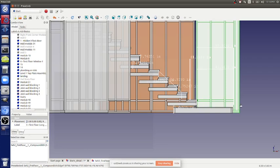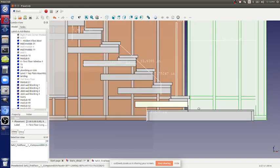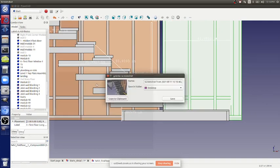From the outer framing, so you can only measure from inside, but the walls are exposed. You see where the wall ends, so you're not on two studs. That's fine. You attach it to these back ones. Okay. So you attach to this stud and that stud for the one that's back there. Perfect. Okay, so that's actually easy. We can locate that. Let's take a screenshot of that.